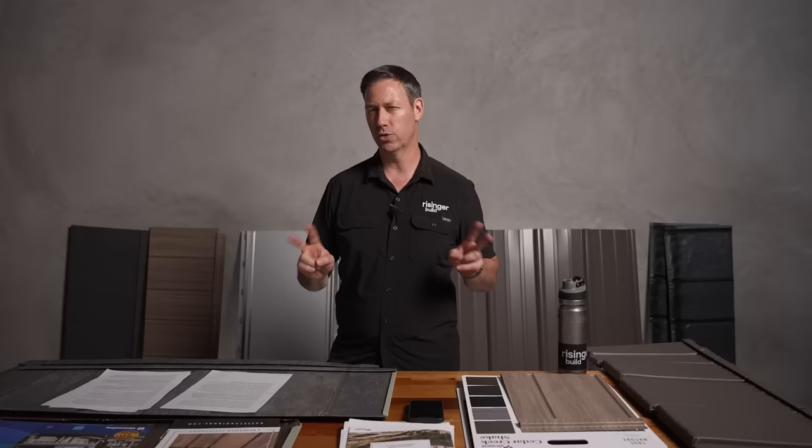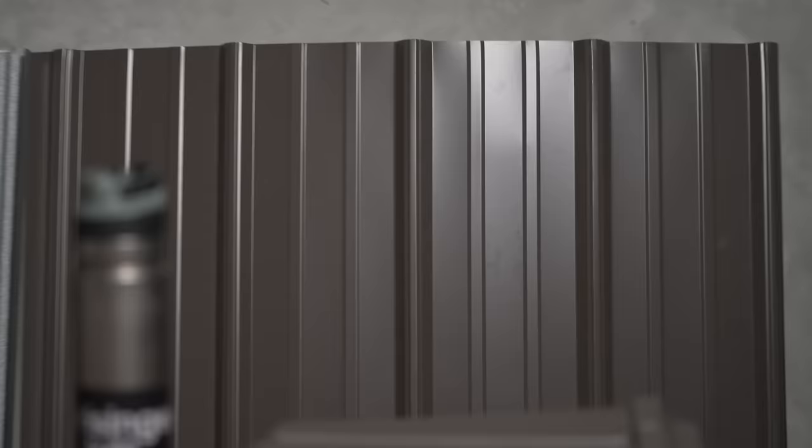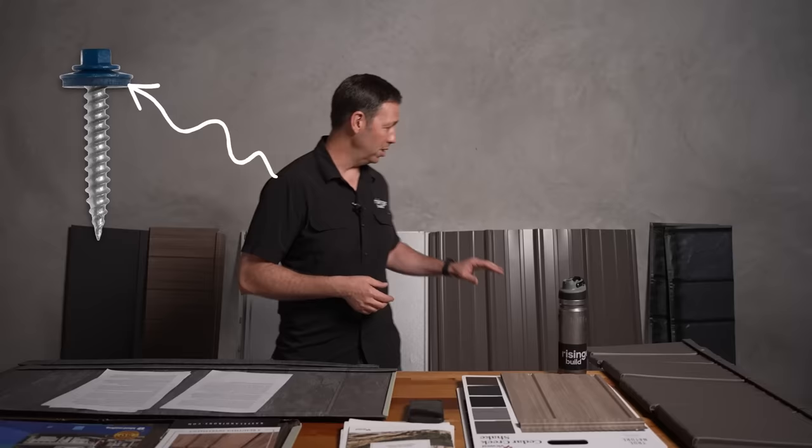Some people think of this when they think of metal roofs, this kind of corrugated metal. It's usually face screwed, it's some version of a shed roof, or maybe a lower cost house that has exposed fasteners. Those fasteners have EPDM gaskets that need to be removed or replaced at some point. Now, this is, I think, a lot of people's vision of metal roof.